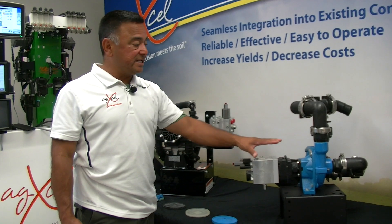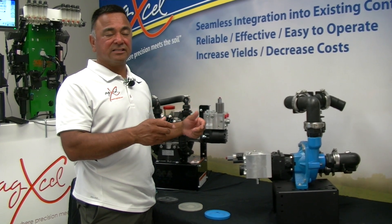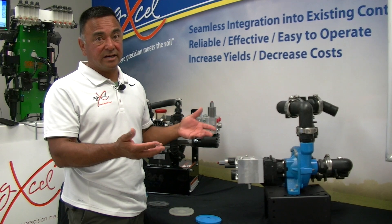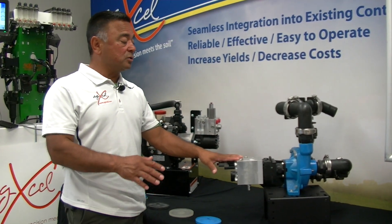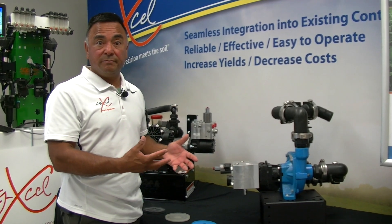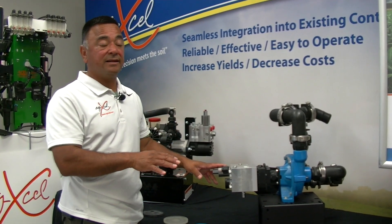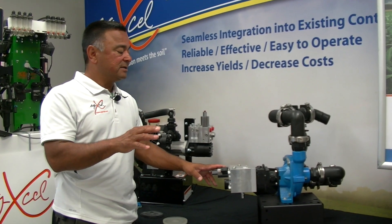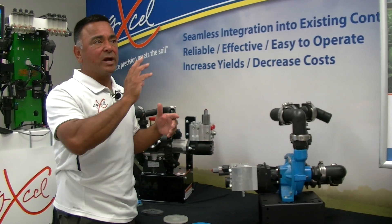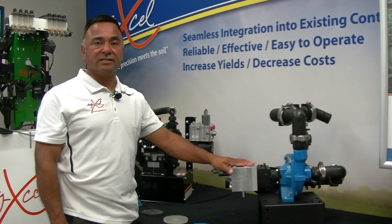Although the centrifugal is rated at 115 gallons per minute, it doesn't do a very good job at approximately 10 gallons per minute or lower. As you go lower, the pump starts to surge and doesn't lock in on its rate because it's not a positive displacement. If you're running a heavier, more viscous liquid and trying to achieve low rates in cold weather, this pump will struggle. But if you're doing one fixed rate — say 15, 20, or 30 gallons per minute, the same speed throughout the field, not doing any variable rate — with something like liquid nitrogen, the centrifugal performs well.